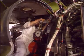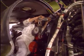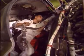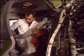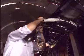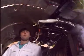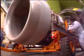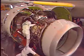Remove the chain hoists and the forward hinge arms. Then the chain pulley blocks and dynamometers from the rear beam. Now push forward the engine from under the pylon, making sure that nothing catches.